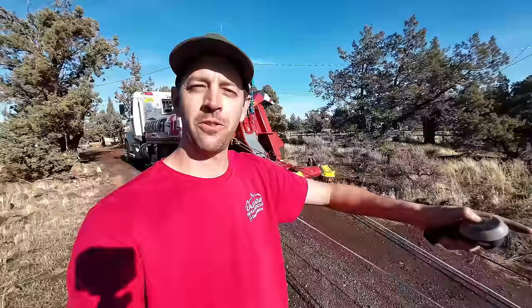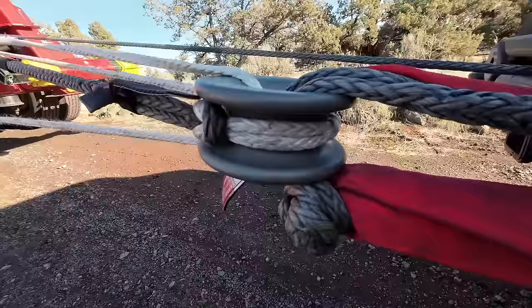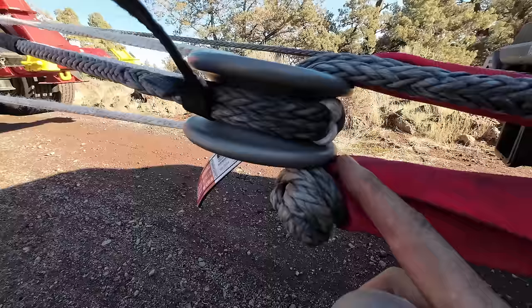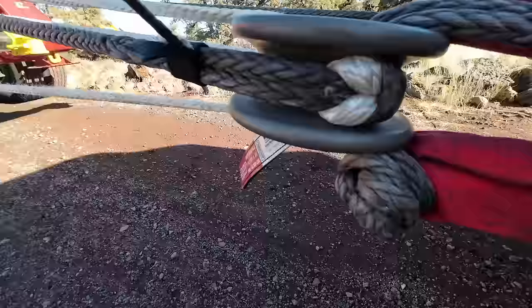This means you can now use all the extensions you want, run out as far as you want, and just pull the whole thing all the way in until your original winch line reaches back into your winch. This absolutely changes how you think of and plan out a recovery and the options you have. As we get down to the bottom ring, it's going to go around the outside instead of through the center. That right there is the reason this ring is as wide as it is — it's almost like someone put some thought into this. That is a thing of beauty.